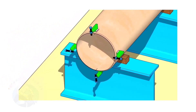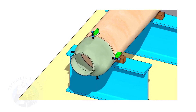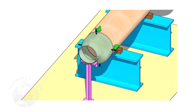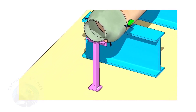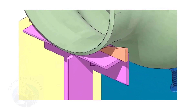If you don't have a pipe aligning clamp, tack weld four jack bolts 90 degrees apart, as shown. Put the reducer in the clamps and slightly tighten the bolts. Arrange proper supports below the reducer — the height of the support shall be adjustable. Here, I used simple wedges.